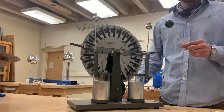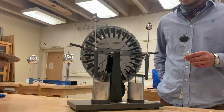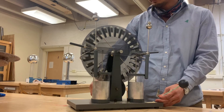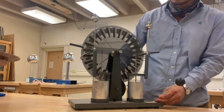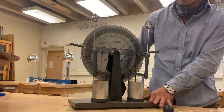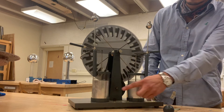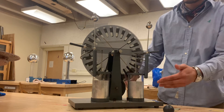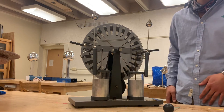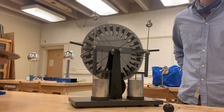I'm going to charge this pith ball on the Wimshurst machine, which is fairly complicated, but the basic principle is that as I rotate the handle you'll see these plastic wheels start to spin, and these will pick up ambient charges in the air and distribute them to these two separate leyden jars. So one side will have resinous electricity, the other side will have vitreous. I'm not sure which one will have which, but that won't matter for this practicum.